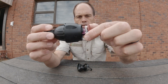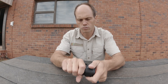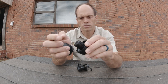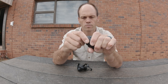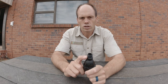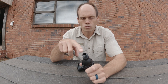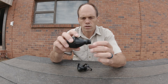I'll just quickly pop this open — that's how it looks on the inside. Such a small little sprinkler; I think it's really good priced for what you're getting. Here's your little filter — cool little thing. It just screws back, 15 millimeter half-inch BSP. If you want to fit it on a tripod, you're going to need a 20 mil to 15 reducer nylon, all galvanized — so it's three-quarter to half-inch and it just screws in.